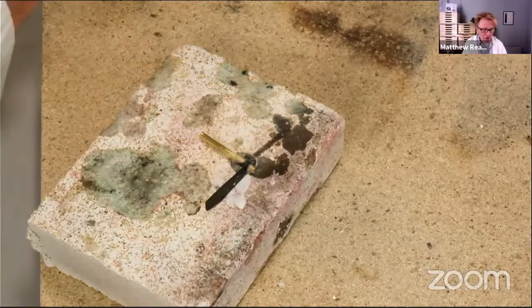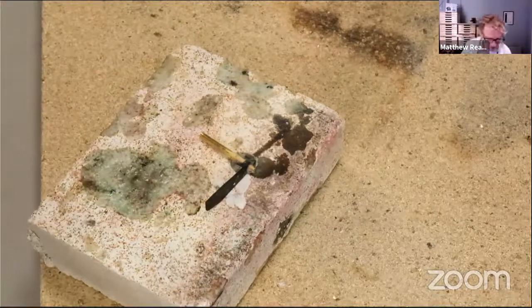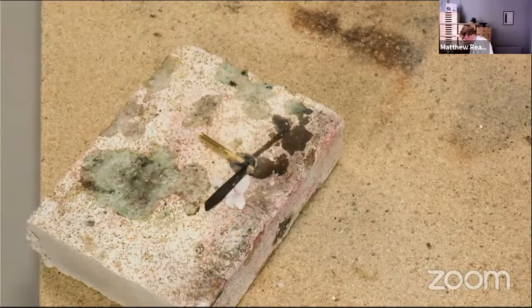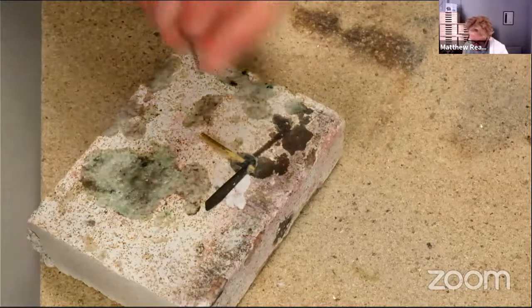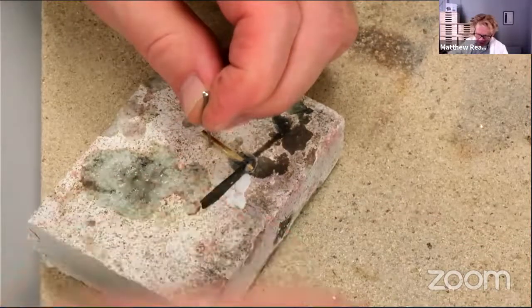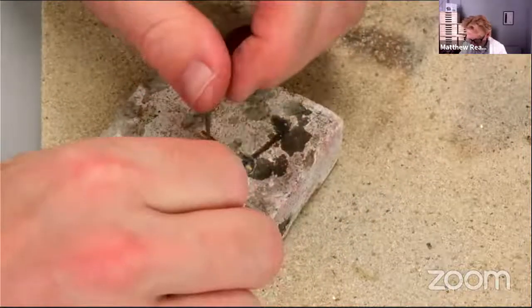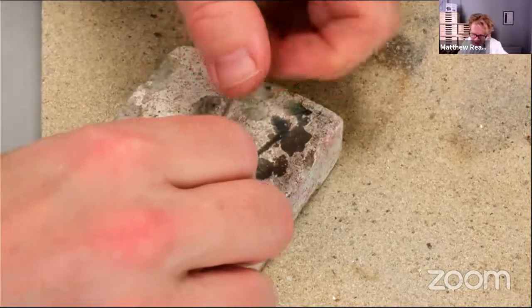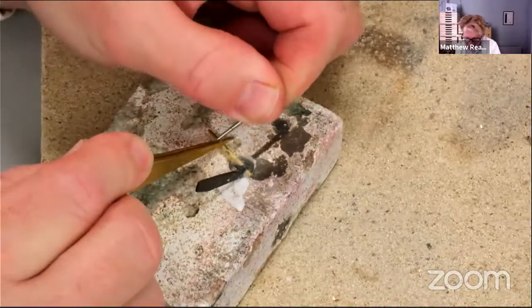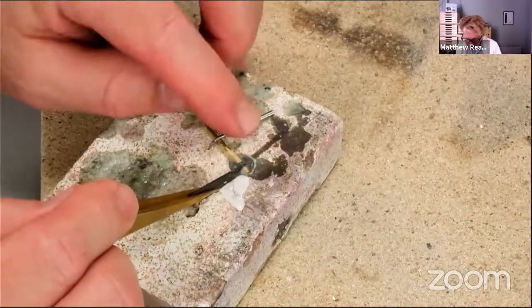So from our Open Clock Club on Saturday, we had some good feedback from the video on the Fusee clock and the Fusee line. One of our YouTube viewers, obviously that event takes place when it's 10 o'clock in the morning or 10 o'clock at night or something for a lot of people, so they can't see it live. And so it's lovely when people leave comments. One viewer has just finished building John Wilding's Fusee driven clock. And he'd put a phosphor bronze line on there, and I was having a bit of a go at phosphor bronze line, so he's taken it off and put a gut line on. So that's nice to have a bit of influence there.